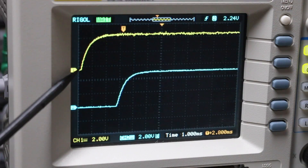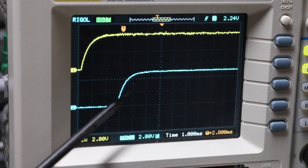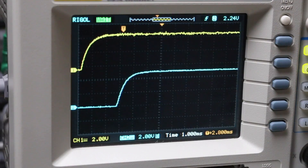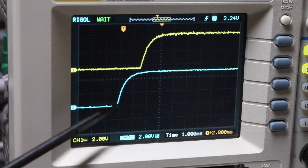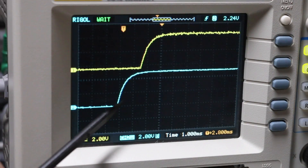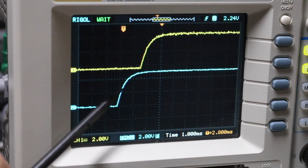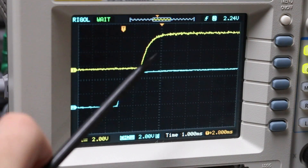With a normal slow rotation we have lots of time. The yellow trace is going high first, and by the time it's definitely at 5 volts, the other trace is only barely starting to rise — and eventually it will register that it's definitely high. I've tried many rotations, and the closest I can get is one rising edge starting, then maybe 1.5 milliseconds later the other rising edge starts. By the time the lower trace rises high enough to register, we still have a good low on the top trace, so the timing, setup, and hold all look like they work out.